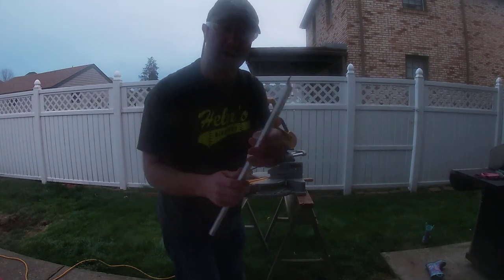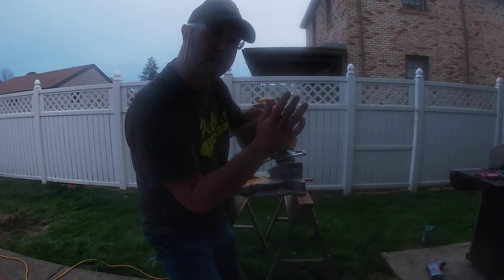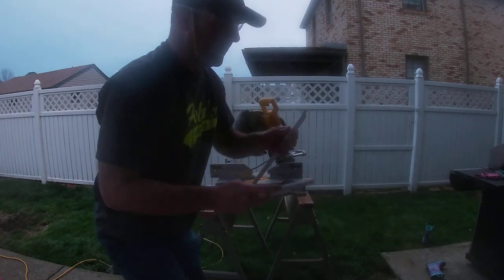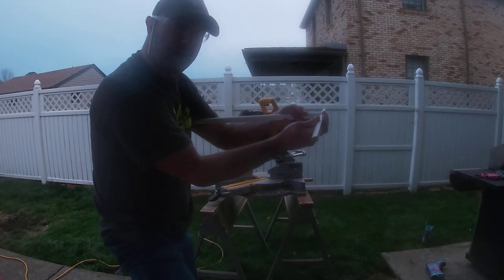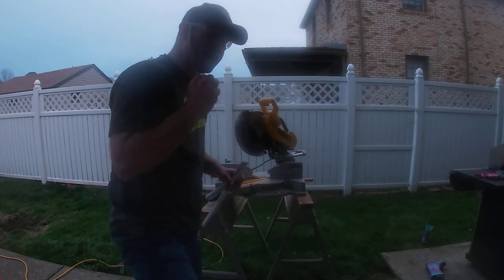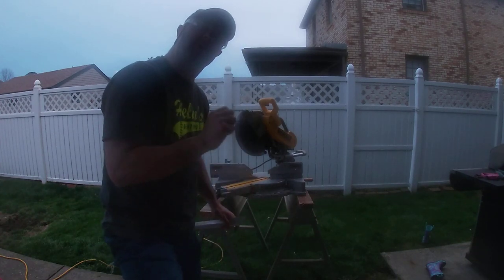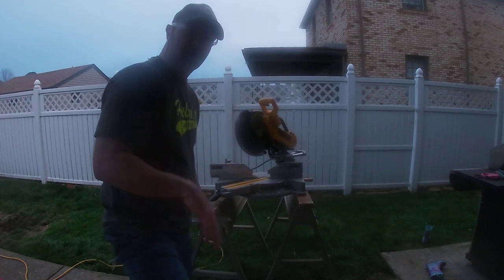This is the cut I want to make right here. As you can see, I took and made that cut and removed the back of this material. If I don't remove enough material out of the back side, it's not going to fit together well. Here's the beauty of this cut — when I make it, those two pieces fit together perfectly just like that in a corner. That is the beauty of a cope cut. As opposed to making two miters, you can make that cope cut, and it's a superior cut because it's going to get you a tighter fit and it's just going to look better. If you get a little bit of a gap, one of the best things you can do is take some caulking and put a small bead on there and it'll look great.